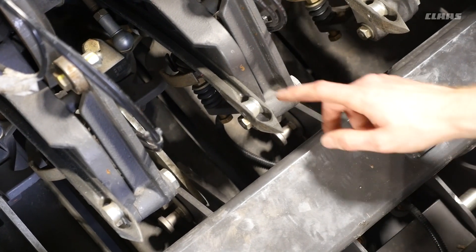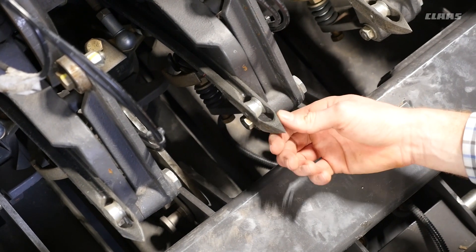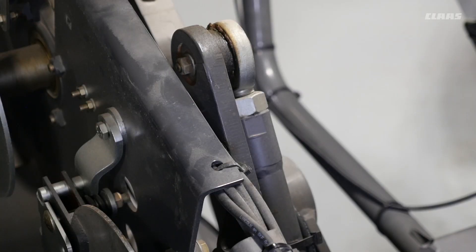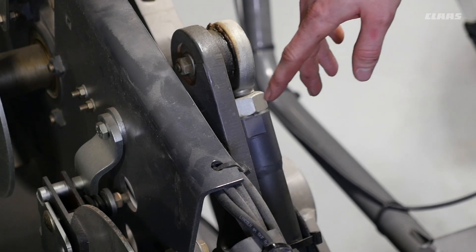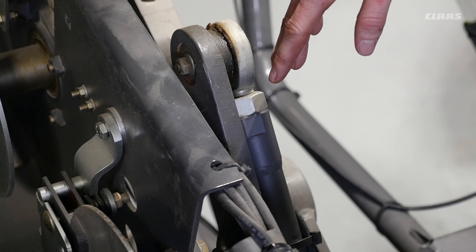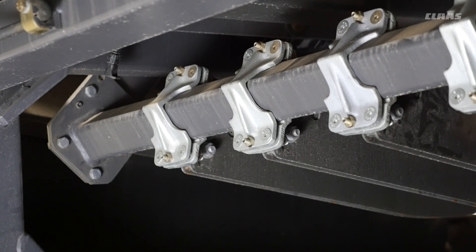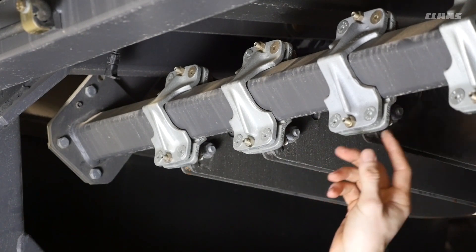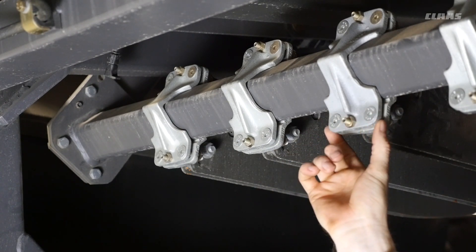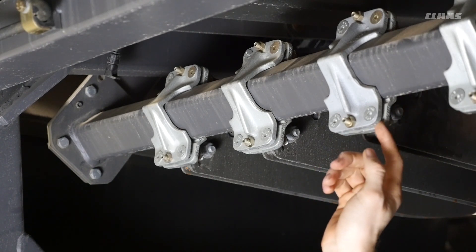We will now check the needle alignment to the knotter. The recommended setting is that the needle rubs slightly against the knotter, but not enough that it bends — you should be able to push the needle very lightly and still see a gap between the needle and the knotter. If additional adjustment is required after checking needle penetration, the tie rods can be used to adjust needle penetration. It is important that needle penetration is fairly equal across the knotter shaft, so it is acceptable if the tie rods are set to different lengths. Beneath the baler, you will find the area for adjusting needle height and alignment. To adjust needle alignment, a clamp secures the needle to a bar, with four bolts that need to be loosened to move the needle left or right as needed. Once the required alignment is reached, tighten those bolts back down and secure it to the bar.